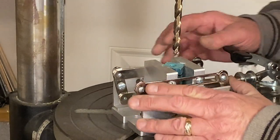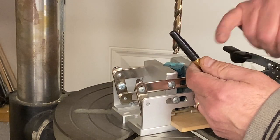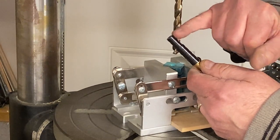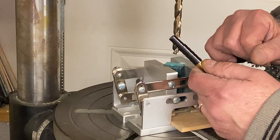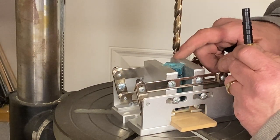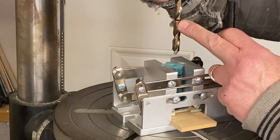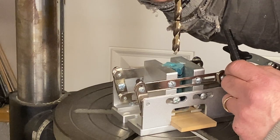I'm making several of these Apollo pen kits, and what I've learned is that the 25/64 inch bit fits the back end of the cap insert better than 3/8 — 3/8 is just a little too tight. So I'm going to go ahead and rerun this hole down to 1.96 inches with a 25/64 inch bit.